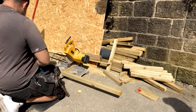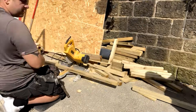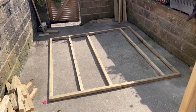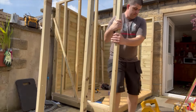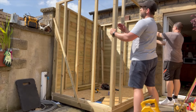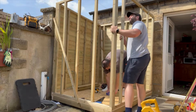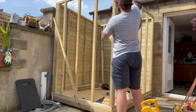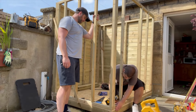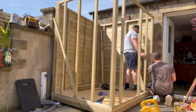I'm going to finish this off with one last stud in the middle, drawing a straight line across both the top and bottom rail, putting a little cross for where the stud's going to land, then double checking the gaps. Following that I'm cutting the studs and passing them to my brother to lay in place, and he's going to fix them in exactly the same way as before. As you can see that is the front wall all fixed together - two fixings either end, using our marks to line those studs up. We take it in place and it slots in nice and easy, and it's just a case of fixing into the adjoining walls with around five fixings in each corner.